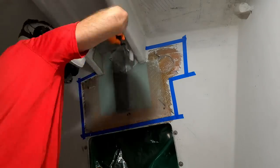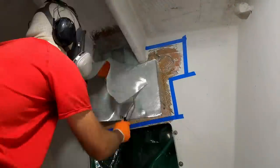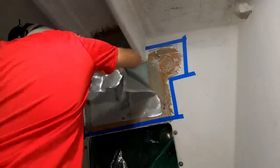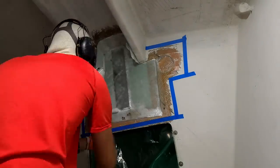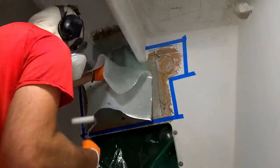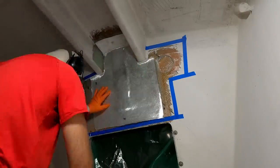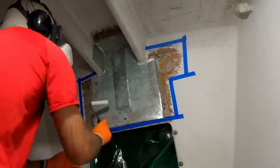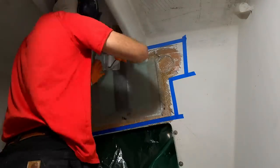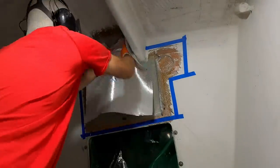Is this the end of the chain plate era? Are you building any more chain plates on the boat? Probably - those would be for the running backs, the check stays. We have a permanent backstay on the boat, but then we'll also have what are called check stays, which oppose the staysail. That's for when it's really windy and we have a big reef in the main and we're just using the smaller headsail. But they have to be anchored to the boat somewhere too, so we'll probably build chain plates for those check stays.